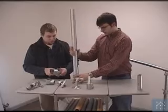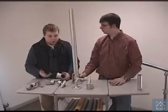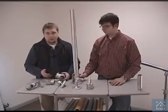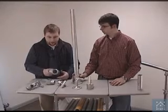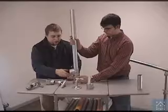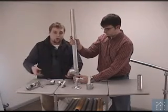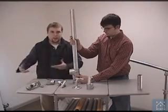Moving on from the base, the next piece we need to build a certified handrail — if you're building it for a ramp, the chances are you're going to need a base rail. Any time your ramp does not have a wall right adjacent to the ramp or a curb of some sort, there has to be something protecting the wheelchair from slipping off that ramp. In which case, you'd want something like this, which is also a variable angle fitting. You can slide this on and then put another size 8 or inch and a half pipe coming off at whatever angle you need for that ramp — whether it be 2 degrees or 10 degrees — to make that base rail so the wheelchair can't slip off.